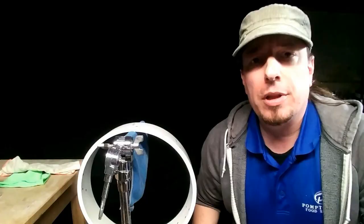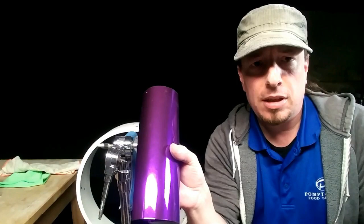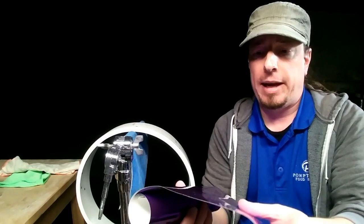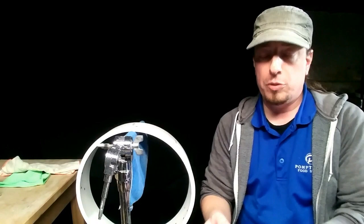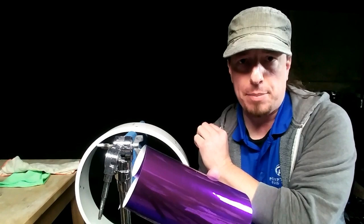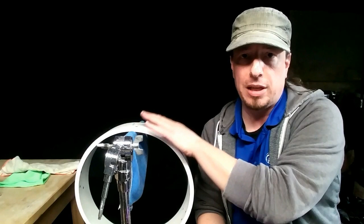Sanding is done. I sanded it down to 400 grit — nice and smooth. The reason I'm sanding it so smoothly is because I'm going to wrap it, but I am not going to be using traditional drum wrap. I'm going to be using something quite different: a very thin sheet of chromed vinyl in a purple color. This is actually used to wrap cars. The reason I wanted to get this really smooth is because any wrap that's a chrome mirror finish — any little imperfection on the surface of what you're wrapping is going to show up like a pimple right in the middle of your forehead. This needs to be super smooth and clean before I put this on.